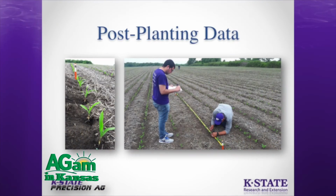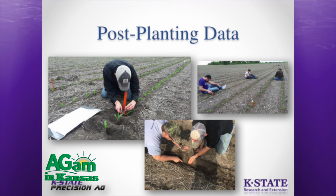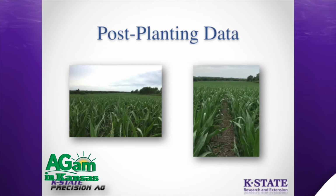Another important thing which we are looking at is planter downforce. There are a lot of newer technologies or systems from different manufacturers. Some people use pneumatic systems, some people use hydraulic systems. But the question producers who want to adopt this technology have been asking is what kind of variability exists in my field? Does it really warrant adopting or having this technology on my planter? Because there's a $15,000 to $30,000 cost in terms of putting these systems in.